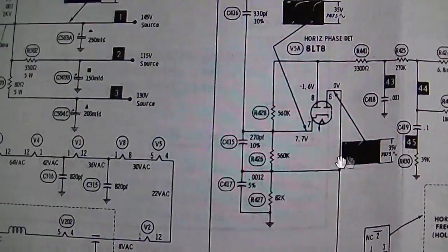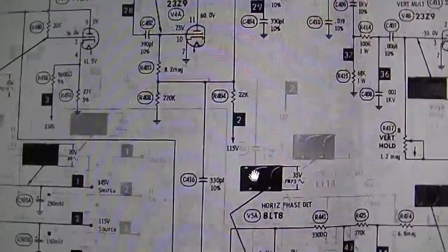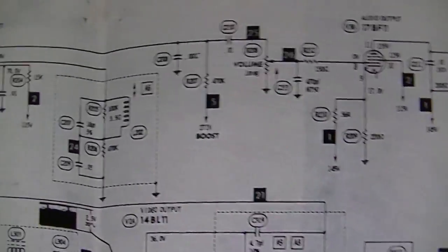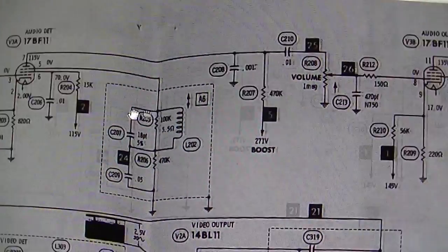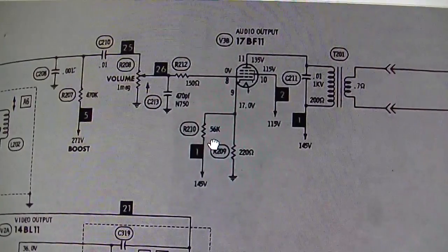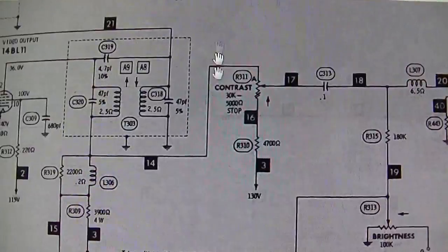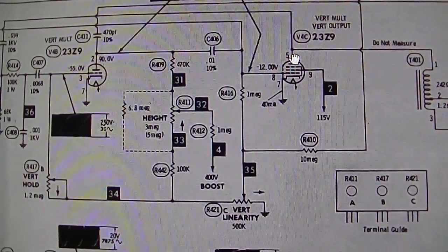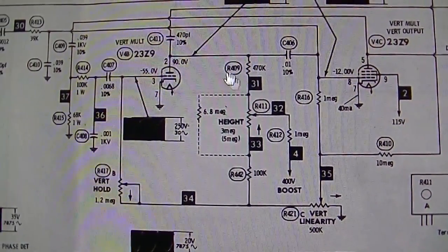This is an interesting one. This is not logically panning out for me. Unless it's multiple problems. The audio, yes, the audio, as in most of these, uses the boost to power the plate of the detector. But again, we might be able to still get some noise through the audio. The audio uses the 145 for the audio output. Yeah, I'm just looking for a common denominator here. You know, why multiple things appear not to be working. And it could just be it needs the boost in order to...